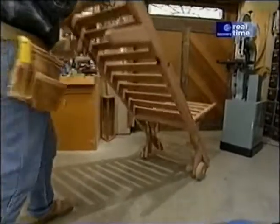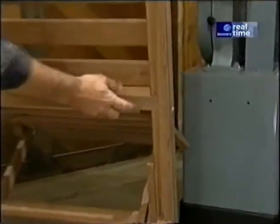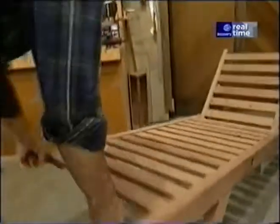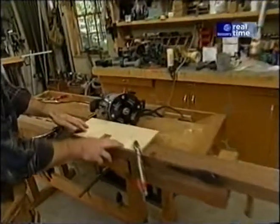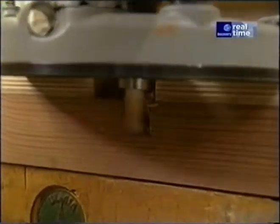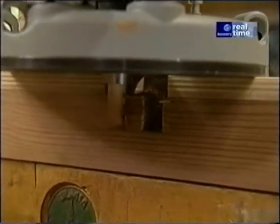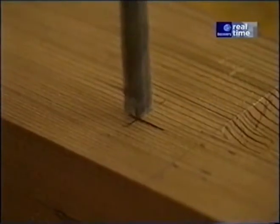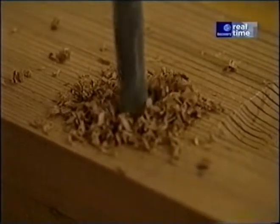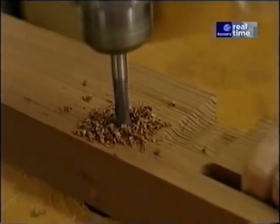Let's take a look at our prototype. There are a couple of cross pieces that connect the rails — they'll add strength to the frame and they sit in mortises: one here near the backrest and another one near the handles. To make those mortises, I've made a plywood template with a cutout and clamped it right over the area. I'm using the router with a collar and the same half-inch bit — the collar rides around the template, the bit does the work. That hole is for a carriage bolt which allows the backrest to pivot, and I want to drill it now at the drill press so it's perfectly square and straight.